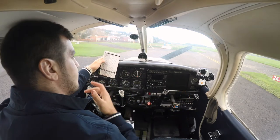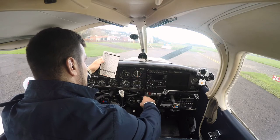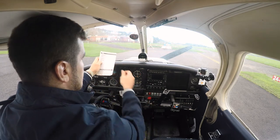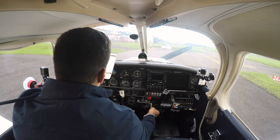Cabin air controls — over here, we exercise them and make sure they're off. We don't want any fumes coming into the cockpit when we start up. Throttle: full and free movement, set a quarter inch. Mixture: full and free movement, set rich — making sure the right amount of fuel is going into the engine. We want a nice rich mixture because we're about to start it up. Throttle friction nut — checked and loose.